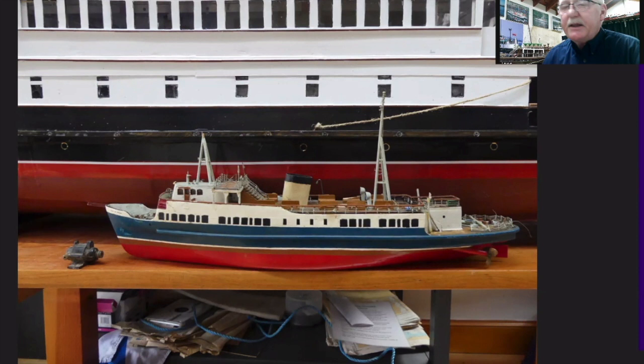layers of pine cut and glued together to form the hull, which was then faired and smoothed. This is the method of construction employed in the majority of the Glasgow Collection models. Indeed, many of them having a thin veneer of mahogany placed between the pine to produce a line in the faired hull to define the distance from the keel and allow for future measurements to be taken off the model.